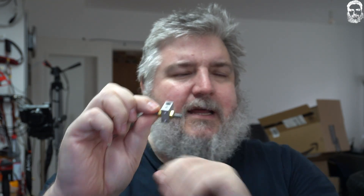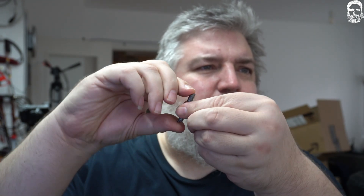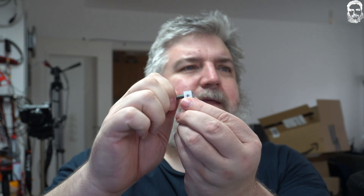In my last update video, you saw that I tried a little self-built thing. This is a standard heater block with a self-milled screw — it's a two-piece screw, and when you join the two parts together, the hole in the middle is 1.75 millimeters. The idea was to screw this into the heater block, heat it up, feed one filament from one side and the other from the other side, melt them together in the middle, let it cool down, and have a spliced filament. But yeah, it was not really working.